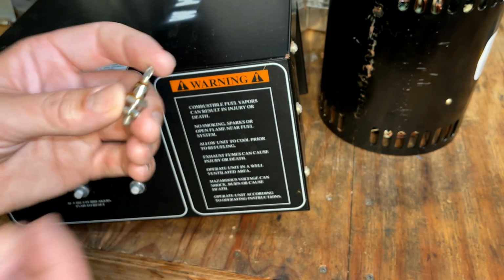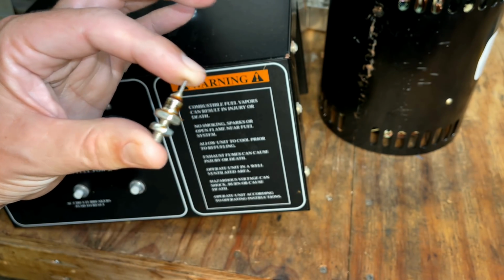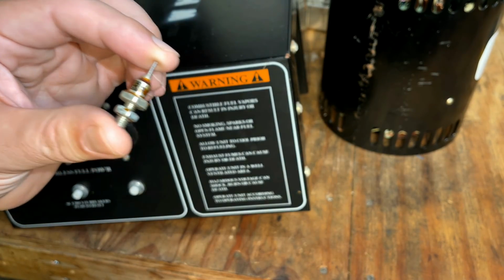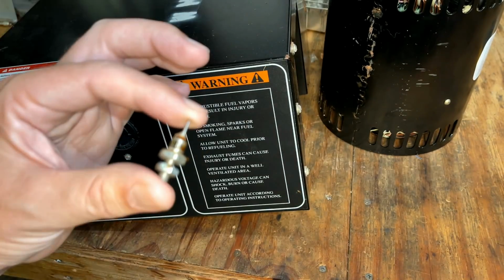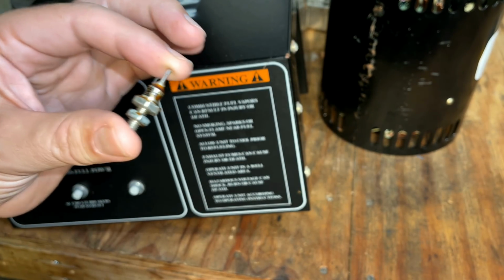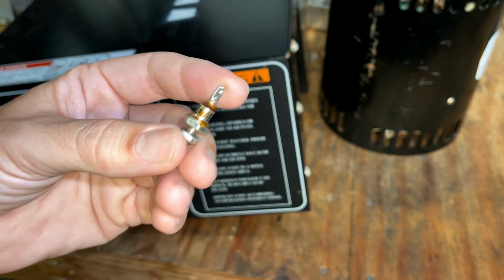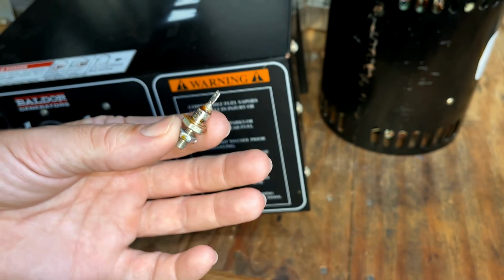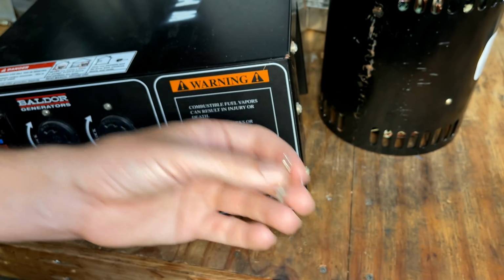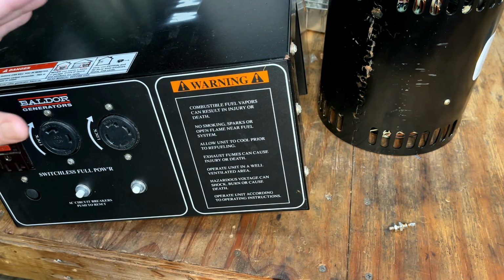You know, even if I can find one that physically is identical, are the characteristics the same? You know, is this a standard diode? Is it an avalanche diode? Is it a Zener diode? There's probably 26 different types of diodes, and within each type, there's probably hundreds or thousands of variations. So it was kind of a shot in the dark ordering a new diode. And it was at that point I kind of decided, fine, we'll just take the generator head off, forget about it.